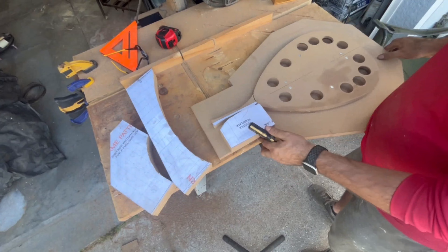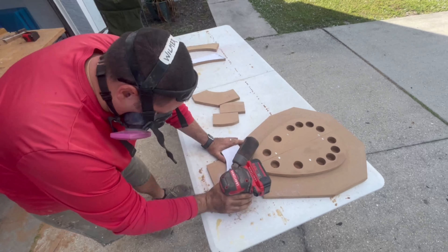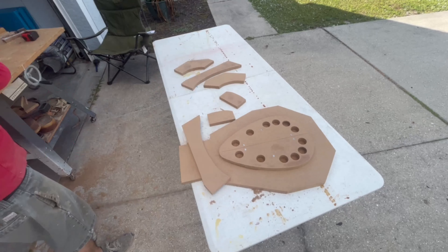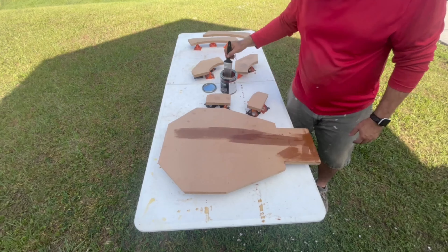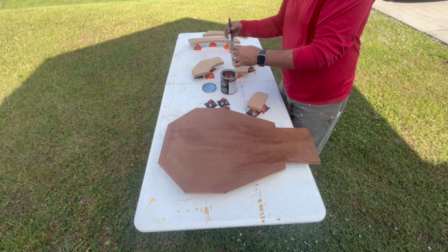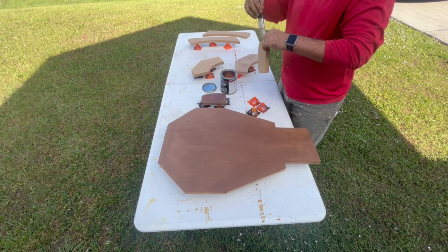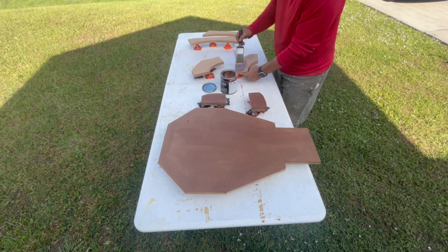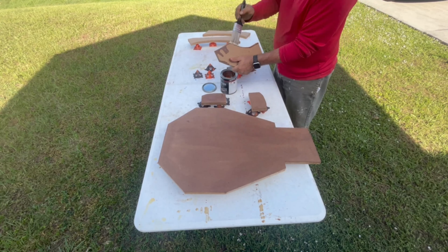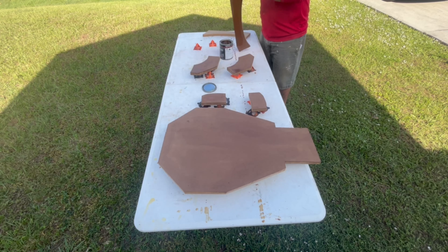I try to keep my videos about ten to twelve minutes long, so this is going to have to be a two-part video. In the next video I'll show you the process of cutting down the maple, walnut, and cherry and actually building and finishing the nets. Here I'm just hitting the jig with some sandpaper and then taking it over for a bit of finishing. It was suggested from the plans to hit it with a few coats of poly — which I thought was odd, I've never polyed MDF before — and then put a few coats of paste wax to make sure the lamination doesn't stick to the jig. But I was still nervous, so I also put painter's tape over everywhere the lamination would be, so if it did stick to anything, it stuck to the tape and was easy to sand off.